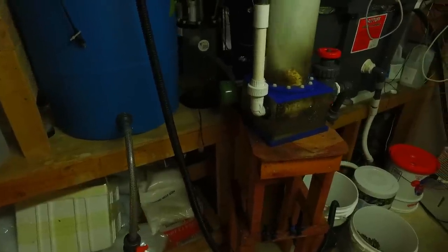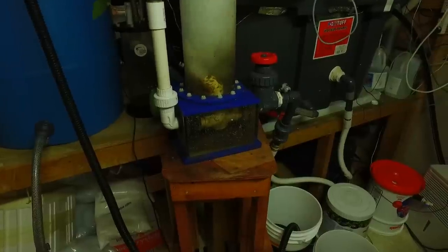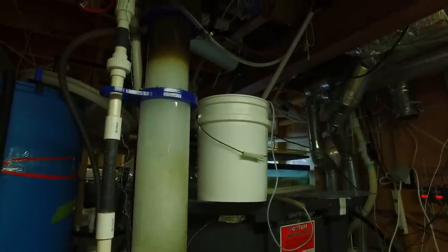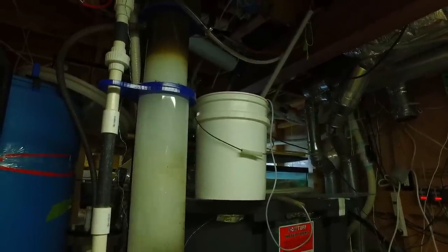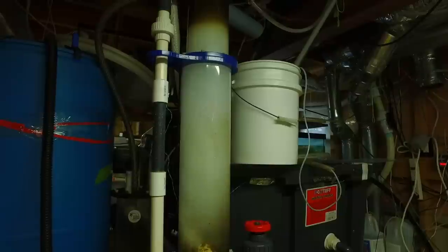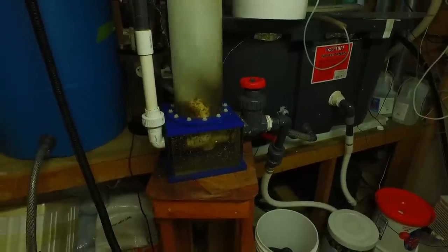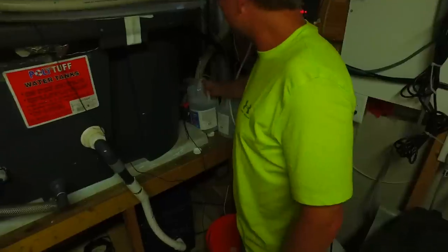For anyone wondering what kind of pump is pumping all this water from the basement — when I first set this up, people said you can't have the pump in the basement, you're going to need a huge pump to push it upstairs. But after a little thought: the higher you put the pump off the floor, the smaller the pump you need because it's lifting less. So if you're going to put something in the basement, make the stand as tall as you can. For every inch you save, you reduce the head pressure.